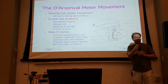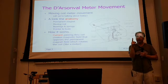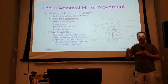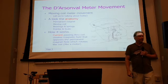And if you look at the scales of most analog meters, if you look at a 50-volt scale, 25 is dead straight up, right? They are actually pretty linear. The only scale that is typically nonlinear on these analog multimeters is the resistance scale. Sometimes that ohms per volt gets pretty critical.